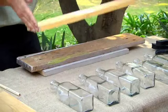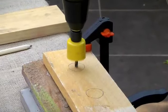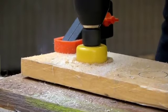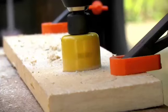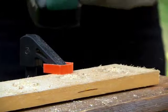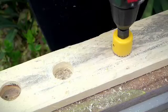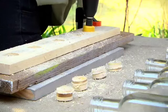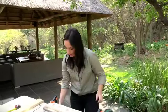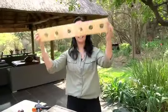The next part is drilling the holes. Clamp your wood and follow the traced-out lines to start drilling. Remember to take special care when handling the hole saw drill bit. Because of the friction between the wood and the hole saw bit, it can get really hot between drilling. So try not to touch it with your bare hands, and allow the saw hole bit to cool before removing the drilled-out pieces. All the holes are made — nice clean cuts.